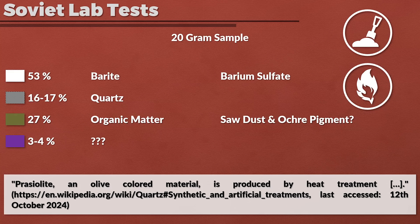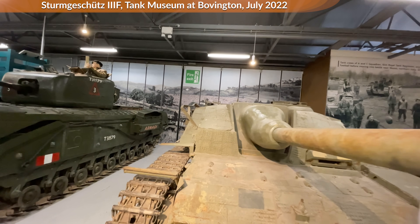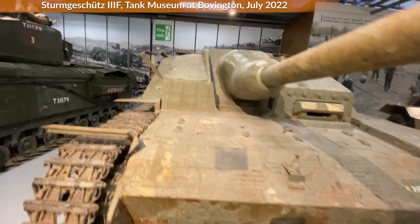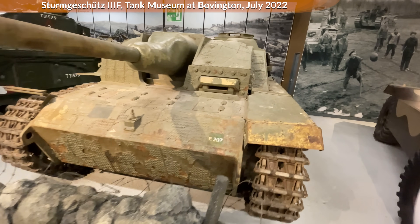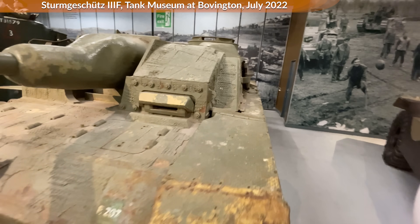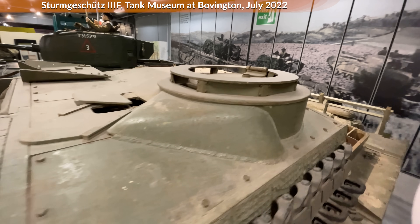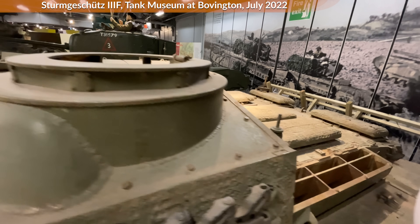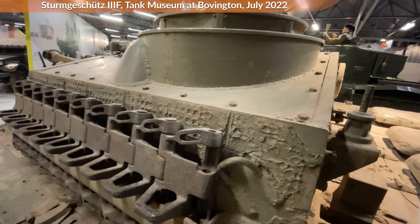About the application: I have a source quoting a German Technical Army publication from 1944. The paste is called 'Zimmerit Schutz-Anstrich' — Zimmerit Protective Coating. The guidelines state the coating is to be applied to all sloped and vertical armor plates on the hull, superstructure, and behind the side skirts. It should not be applied to side skirts themselves, skirts on the superstructure or turret, turret, commander's cupola, bottom horizontal fenders, removable equipment, exhaust, lights, or armor plates covered by fixed or removable parts — for instance if those parts are behind the track wheels.